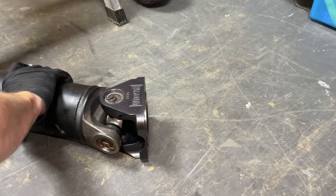Yes, it is. Oh, yes, get used to that. That's what I'm saying. Having a locker in is not very nice. It makes the steering really heavy. To do a turn with it, you have to be doing 5 to 10 miles an hour, to even get it to turn. That's why I took a locker out of mine. I kind of learnt that by revving the engine a little bit, you unwind the differential and it also gives a little bit more pressure for the steering pump.